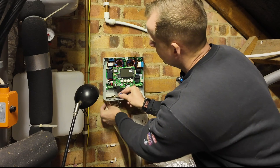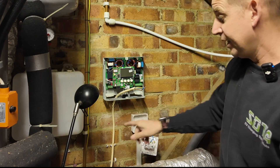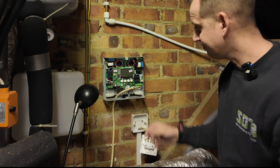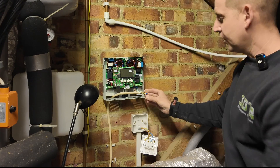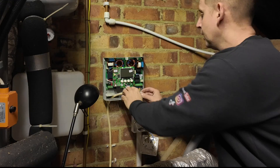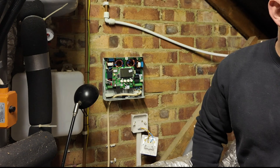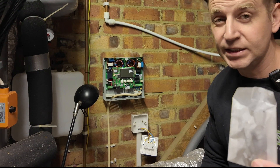This cable goes to the load side but I'm bringing it in from the other side because I want my supply cable to come up here — I don't want my cables to cross. The brown goes into H1, the blue goes into neutral, and the green-yellow goes into the earth terminal. Make sure you put your cable into the cable supports — the screws for those are in the little bag inside the CT box.